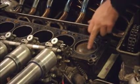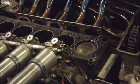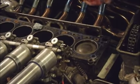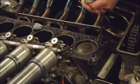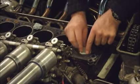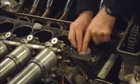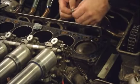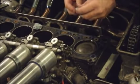Hello. Cleaned up the top of the piston. I'm using this as my test cylinder. And I'm mushing up my 900-year-old plasticine, which is just about starting to cooperate and become all squidgy mushers, as we want. And then I'm going to squodge this over the top of the piston. Got the head gasket on, of course. Like so. It doesn't really matter if it sticks to the piston or if it sticks to the valve, just as long as I can measure how thick it's gone.